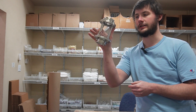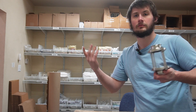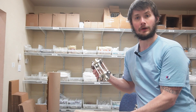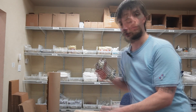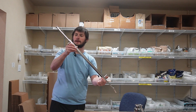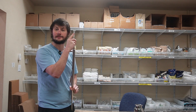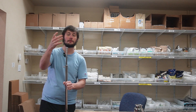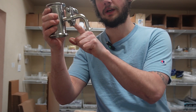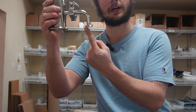This is our infusion basket, which is probably the biggest selling point of our pro models. This is where plant material, botanicals, and different media sit to add flavor. If you're in pot still mode, you connect that right to the bottom extension. Or if you're in reflux setup, put in the reflux chamber first and then put this on top. This right here is a condenser for a lot of our pro models — even though it's much smaller, the same tri-clamp rules apply. And this elbow at the top has a tri-clamp, and we attach our condenser through the other end of the elbow.